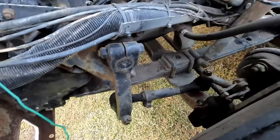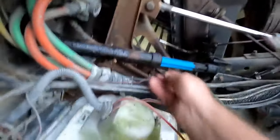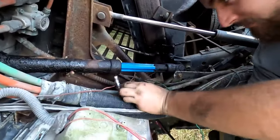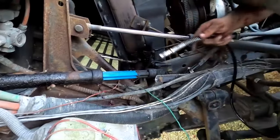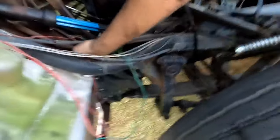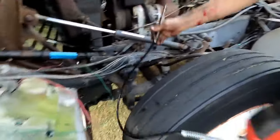Could you imagine having to do this with your old pump-it-yourself grease gun? There's probably a grease fitting on this cylinder — yep, that's one also. It looks like it's probably got enough grease in it but we're gonna hit it anyway. There's probably a grease fitting on this cab swivel here — and sure enough, there's also a greaser on this freaking steering shaft. We gotta grease the front kingpin at least.